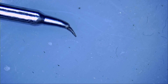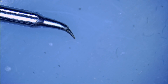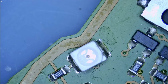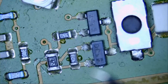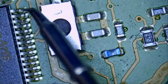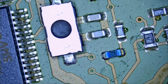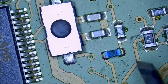Here we have the 15J tip — look at how fine this tip is, it's amazing. This is used for micro soldering work: 0105 size components, 0201, even 0402 size components. Do not use this for 1206 components — not enough heat transfer. I have a Benz key fob motherboard on the bench, and look at the size of the tip — you're able to get to very tight areas and solder each pin individually.